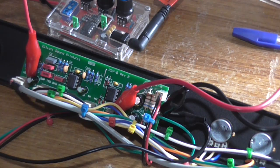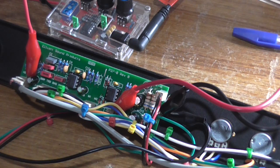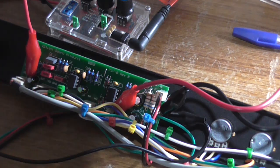So what do I think? Well, that master volume control is going to piss me off when using it due to its current operation, and I can't for the life of me figure out why it's doing what it's doing. That was a soldering iron. Maybe someone in the comments section there can shed some light. I've eliminated all possibilities. Op amps, the high frequency bypass capacitors for the power supply lines to the op amps, the diode limiter, ground wiring, stuff like that. I can't even begin to fathom what's going on here, but that's just the way it is. I might reinstall the 220 ohm resistor because it doesn't make any difference with it in or out.